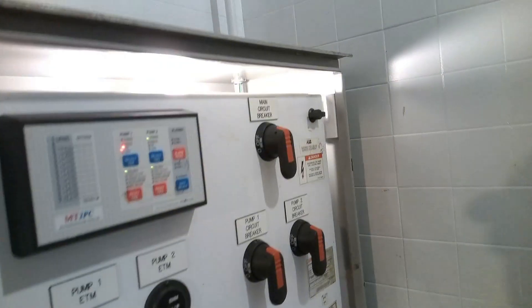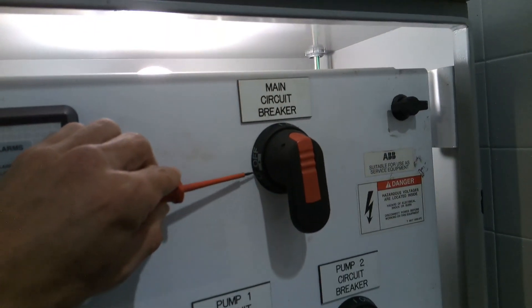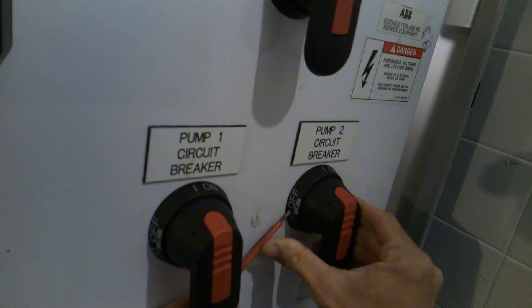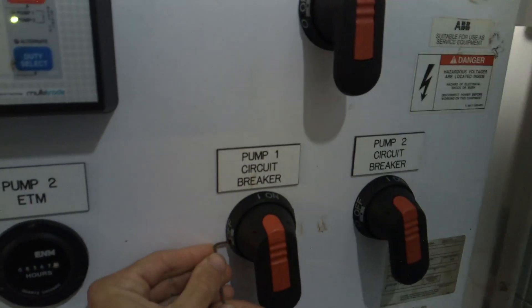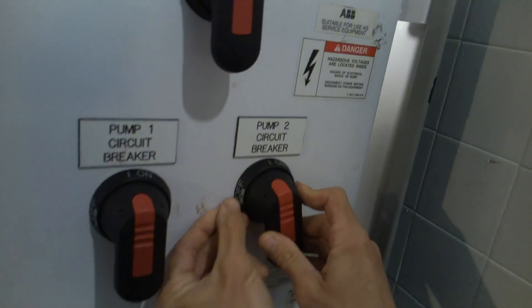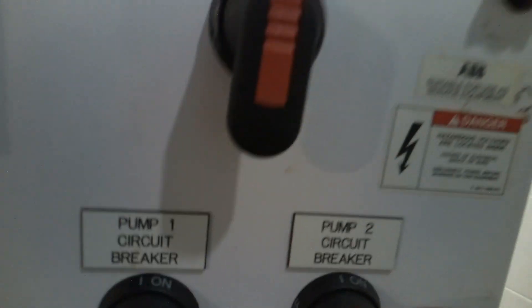Alright, we're on site. Is it safe to stand on? Yeah, okay. Is he the one who changed the pump? Me and him, okay perfect — it's a brand new pump. You turn on the pump, you hear the pumps kick on? No noise. The amp shot on the 28 but there's no noise. One is in off, two is in auto. It's just a pain when there's multiple switches.